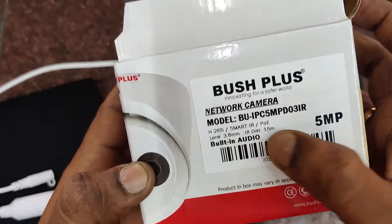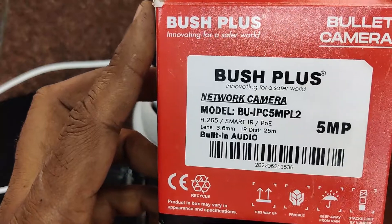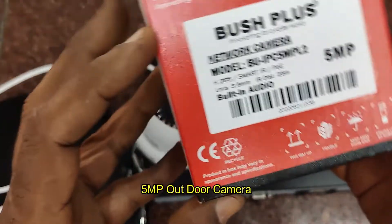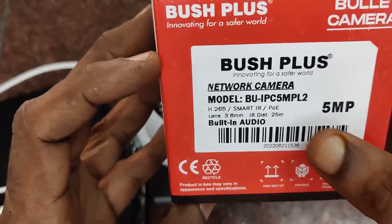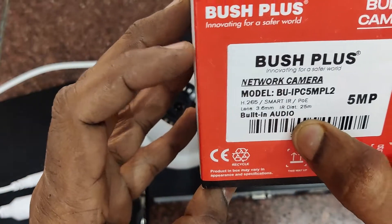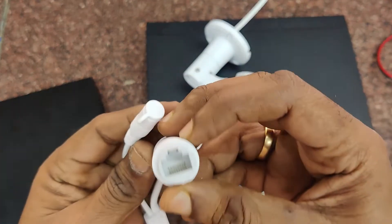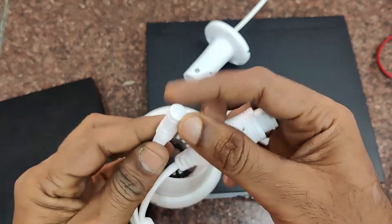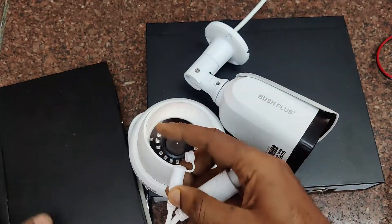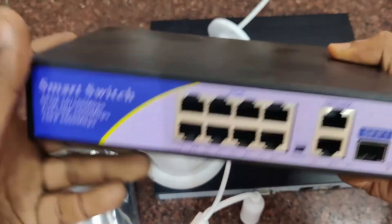In this demo we will be using a 5MP camera — a 5MP indoor camera with a 3.6mm lens. All cameras are IR, meaning night vision is enabled, and audio is also enabled. Unlike analog cameras, you need not provide any extra circuitry for audio input; audio input is built in. These IP cameras have an RJ45 connector as well as a DC connector. As we are using POE, this DC connector is not required.